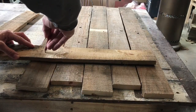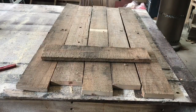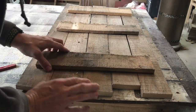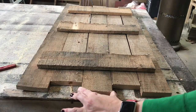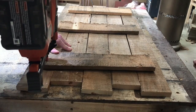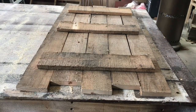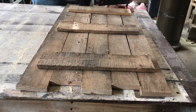So I'm going to take a board, cut it short, and stack it vertically on the side — this is the back of it. I'm going to cut three pieces the same length, and that way we can attach them to the back and that will hold everything together nicely. I'm going to take those three boards and brad nail them onto each one, putting two brad nails per board all the way up, holding everything tight. That's just going to keep this sign together.